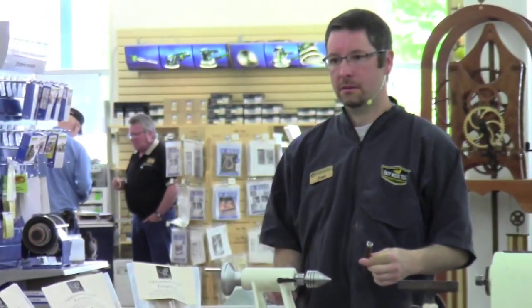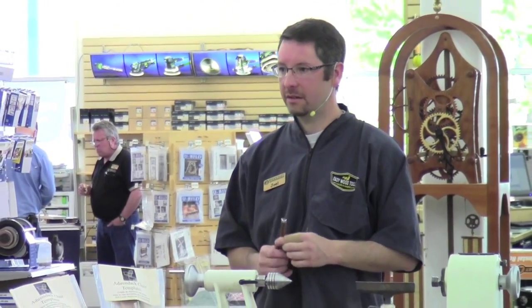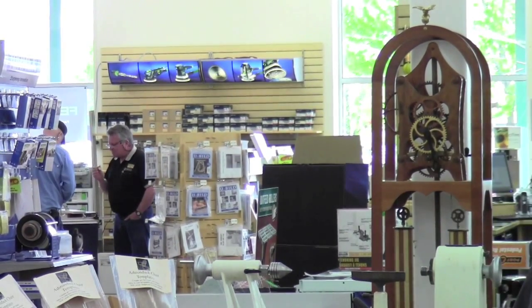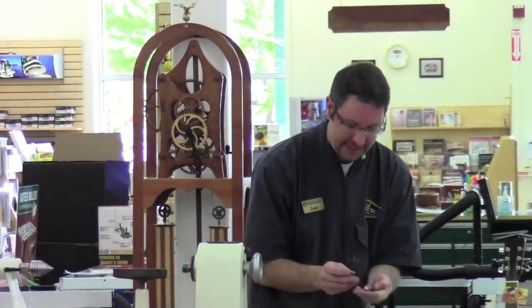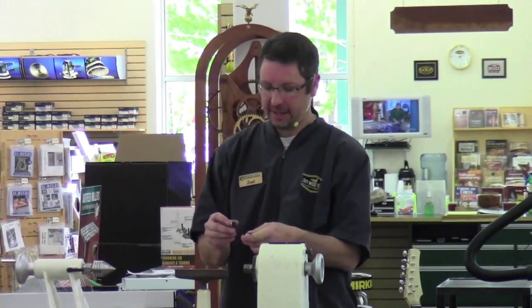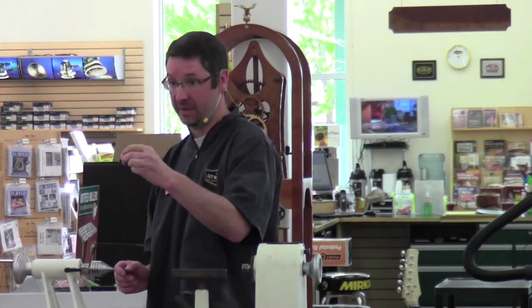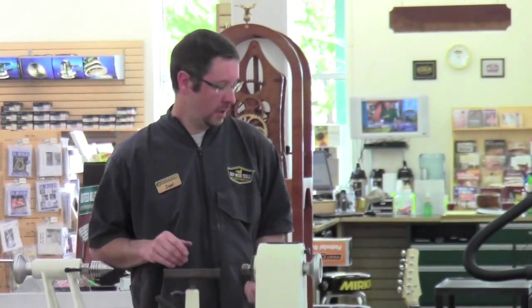How do you know how to keep it without measurement, what matches with the ends and top? Bushings. The bushings are perfectly lined up. Once put in their exact same place, they will be your guide in how far to turn that pen down. Is there any other questions? Any more?